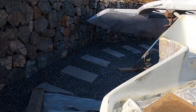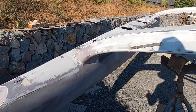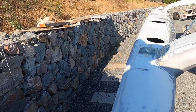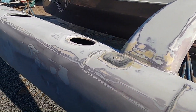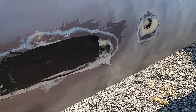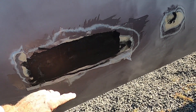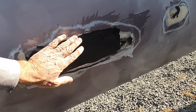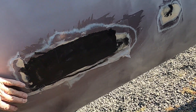The rudder cassette is off and all this has been cosmetically cleaned. Both sides of the port float hull were sanded today, all done to 120 - it's ready for primer. Here's the second patch - the one I did while I was on the phone with Damien in Mexico. We put thickened epoxy underneath, then one, two, three layers of carbon build-out to fill in a dent. Hopefully Sunday we'll put some filler in that and then longboard it out to get the shape back.